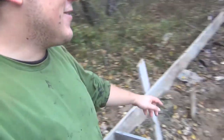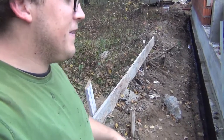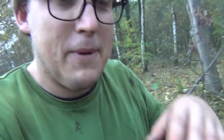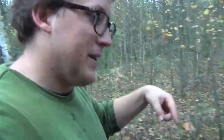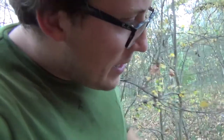Alright guys, we managed to get through the trench here with the bitumen mass. The tar paper is thick, two layers, maybe an overkill, but really that's the most critical part, because that's where the tar paper and the concrete meet. So if the concrete is to pull up water, it will probably get through there, because it's easy to do a solid layer of bitumen on the wall.